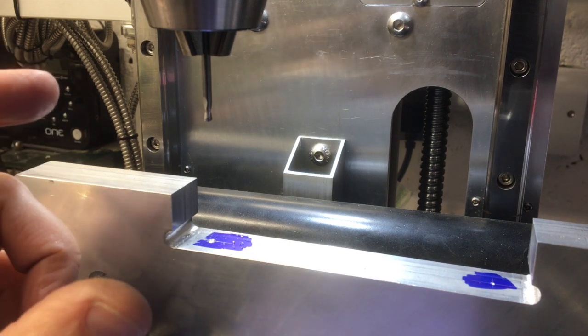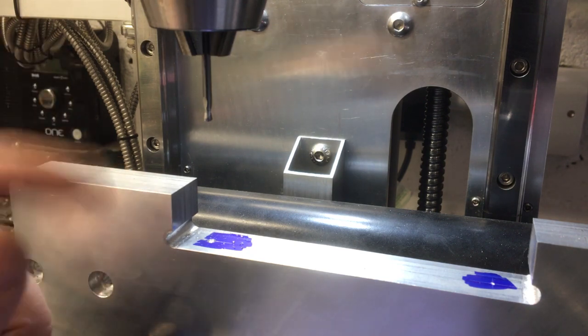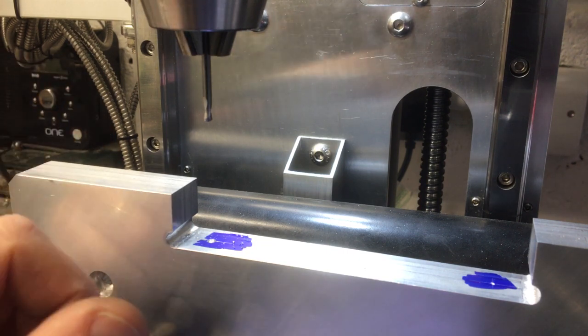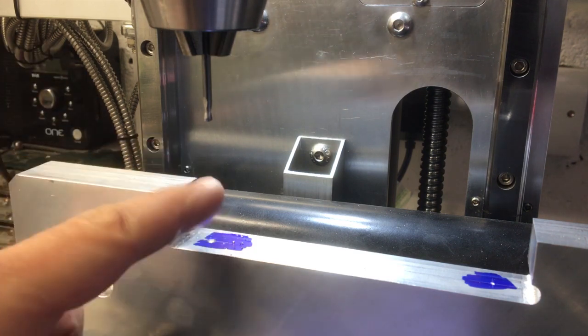I'll just turn those, because now I know I just need the 2 speeds, just that low and medium speed pulleys. I don't need the full 5 because I've got the inverter to do that. That should help an awful lot, so it won't fluctuate as much, and then we'll see what the noise is like and take it from there. I might have to do something more drastic, but for now it's working, so let's drill this out.